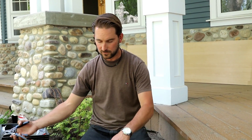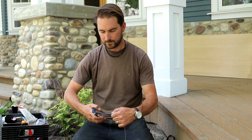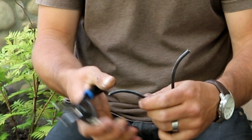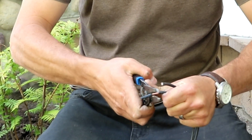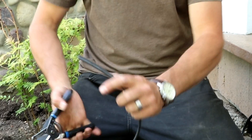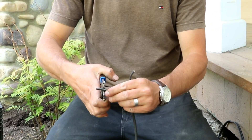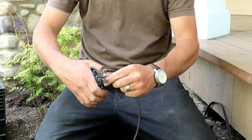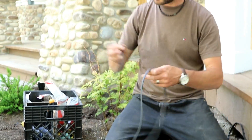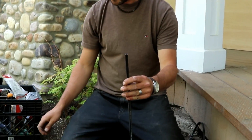You just take your line that you need to cut into — make sure you've got some extra wire to play with — and cut into it. You're going to strip off the ends of both sides of that wire. You only need to strip about three quarters of an inch to an inch off the ends, that's all you need. Then with whatever wire you're going to run out to your fixture, you lay that out and strip the ends off of that as well.